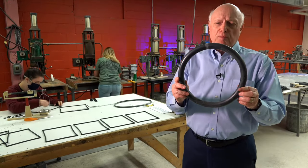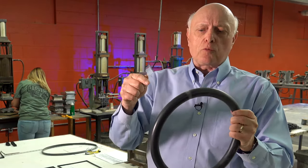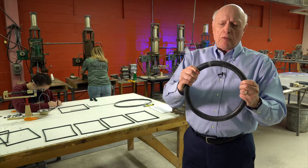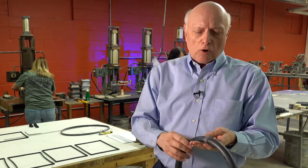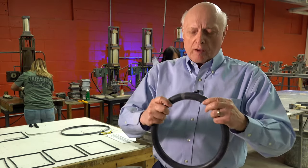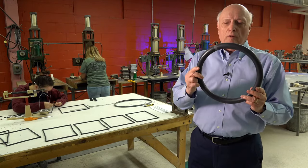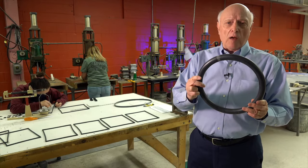Here's an example of a butt splice gasket, which is used just like an o-ring. We can do these where they're solid or with a butt splice where they have a hollow ID. It doesn't have to be round — it could be rectangular or any kind of special shape. As long as we have enough of a wall, we can make a bond. The advantage of a butt splice or a molded splice is that it stands up and won't fall apart.